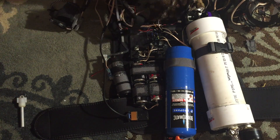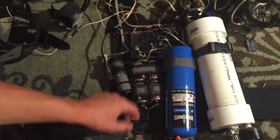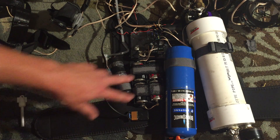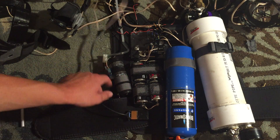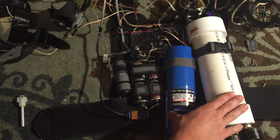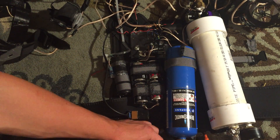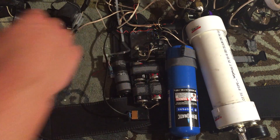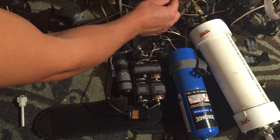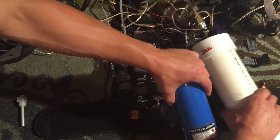If we come around here to the back, you can see there's actually quite a bit going on. I've mounted the flamethrower — that's what these two things are. I've mounted the circuit board and everything. I took off the Arduino, got the batteries mounted, got another battery mounted, got the pilot light mounted. One thing that's pretty interesting is this whole flamethrower piece can actually come off. I designed it so you can unsnap these buckles, unsnap this buckle, unsnap one more down here, undo this tube right here — there's a clip right here that you can undo and then this whole flamethrower will actually pop right off.